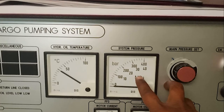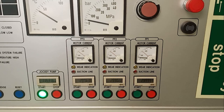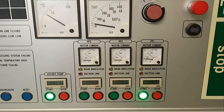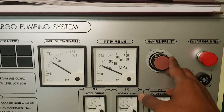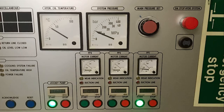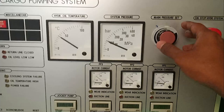I have confirmed the system pressure is turned fully anti-clockwise. Now I press the power pack number one start button — you can see the current suddenly went up and came back down. The light is blinking; we wait for it to stop blinking. Once it has stopped blinking, we check the system pressure, which is now steady at 100 bar. For starting power pack number two, we cannot go to zero pressure, so 100 bar is our minimum starting point.